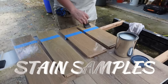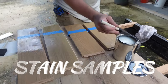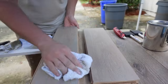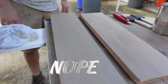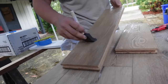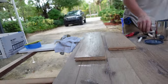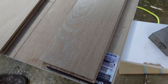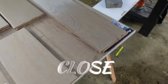I can be obsessive sometimes when it comes to getting stain colors right. It is really tough when you're matching a product like vinyl to a wood, because the vinyl or the laminate — the artificial product you're matching to — is just a photograph in essence. And we have a natural real wood product where no two pieces are going to look alike. With the vinyl, you have repeating patterns and everything is pretty consistent.